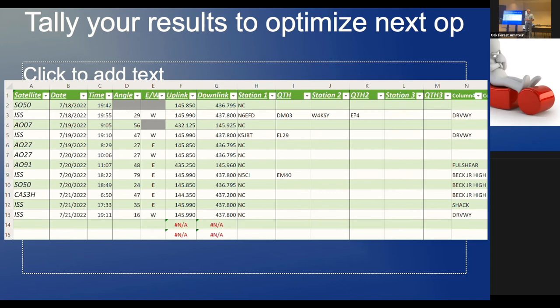Can the astronauts on the space station talk to you? That's a good question. Yes, you can hear the astronauts if they're inclined to have a QSO, but it's not on the repeater frequencies. If you go 145.990 uplink and 437.8 downlink, you're talking to their repeater — like a regular repeater but 427 kilometers up. They also operate NA1SS, which is the space station ham call sign, and that's a different set of frequencies where they talk to schools and groups.